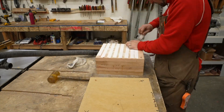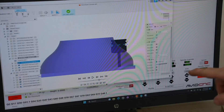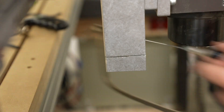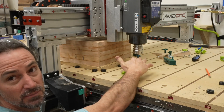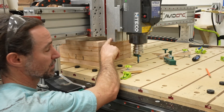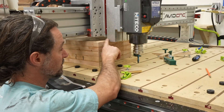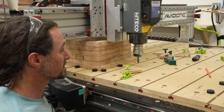I glued up all my good pieces to get a starting stock piece that was five inches thick. The simulation in Fusion 360 showed me that the Z gantry mount on the Avid CNC would potentially hit the bowl when cutting at the deepest point. I decided to go for the simple solution of just trimming that part off. I did simulations in Fusion 360 to check the statistics on how high the gantry would be, jogged to just below that point, and figured it should clear since material would be removed before it reaches the deepest cut. I was pretty nervous about it.